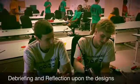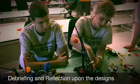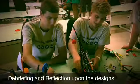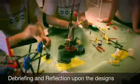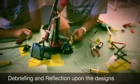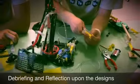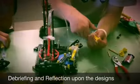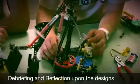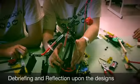And there's a piston, or a syringe, that's attached to a gear right here, and so that one is able to spin, and this gear spins so it can turn the table, or turn the tower. There's a rubber band right here, which was more useful in our original design. We had to go back because we wanted to change the gears, but originally this was attached straight on, so it helped push it back, and it still gives it some support when pulling it backwards. So that gear system turns a tower, which is based on the gear and has another one on top, so it can screw straight into it.